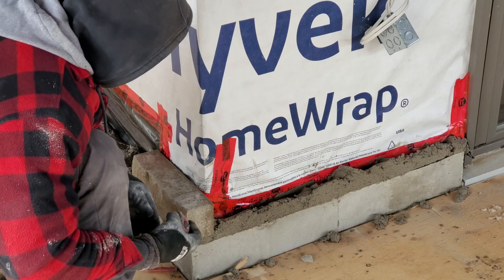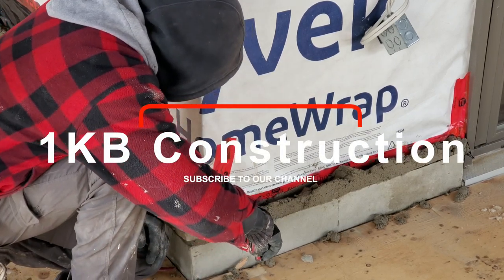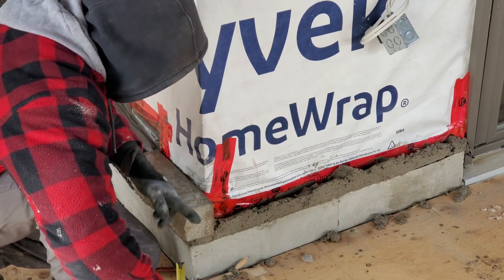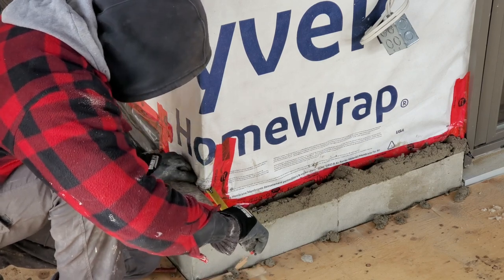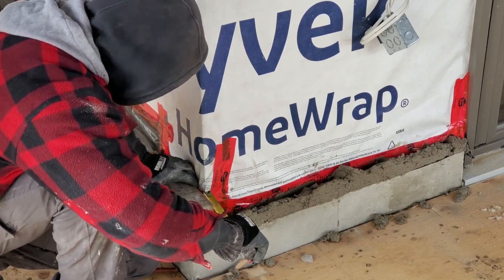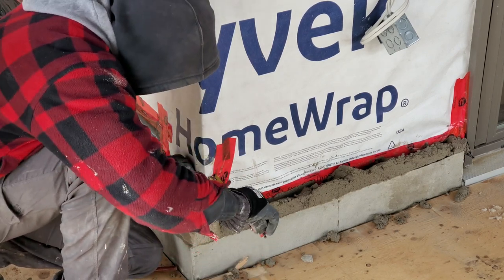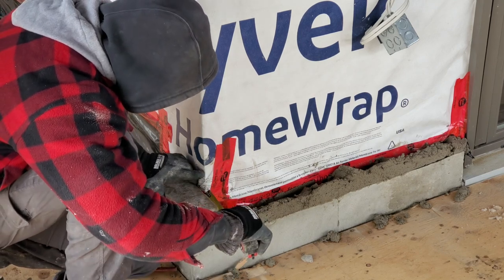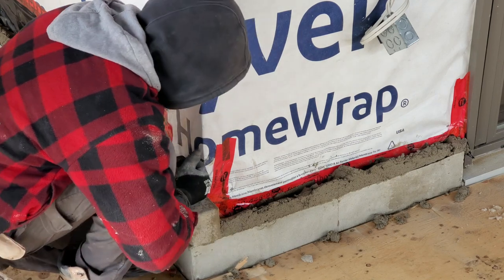Okay, so sometimes you might run into certain cases where your ledge is only like 2.5 or 3 inches. So what you wanna do in a case like this, you wanna put your stone right here, and from here you wanna measure out 4.5 inches. So you want to bring this stone out around 4.5 inches, just like that. So from the wall to the pitch of the stone, 4.5. And that's where we're gonna have this one.